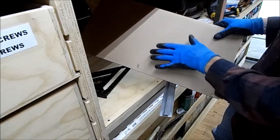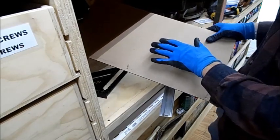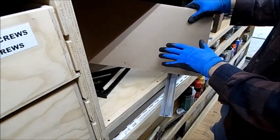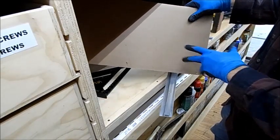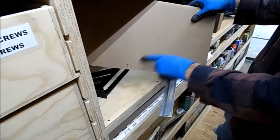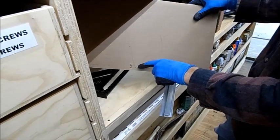the slope is a 4/12, but sometimes you get into an angle that you don't know what it is, and you have to determine what it is. Like when I did the stair project for Peter and Stacy Dodgen, the winding stairway. And every one of the treads was different. So you had all kinds of angles to work with. And so I had to take each individual angle, and this is the way that I did it for the trim pieces and so forth, to make these miters and to make the trim fit.